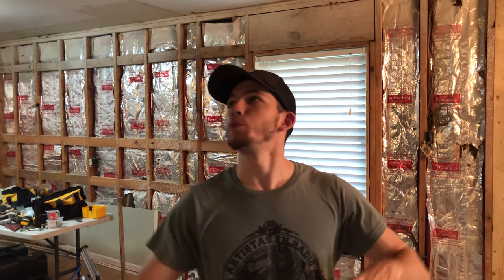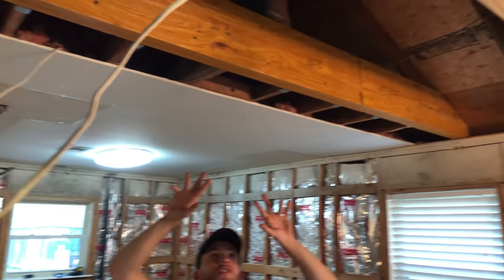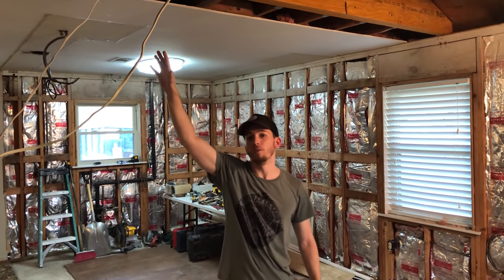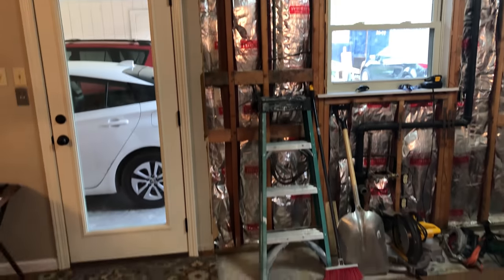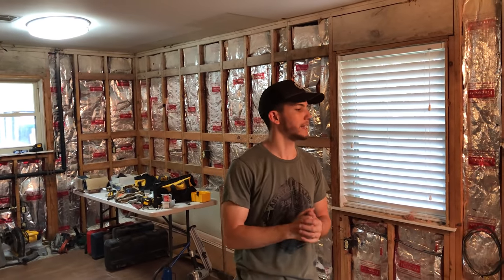All right guys, that is going to be a wrap for today's project. We have our beams up, installed in place. The only thing left is the double joist hanger right above me and we also have to install some filler joists between the two beams. The work site is clean, the beams are installed, everything went swimmingly. We've got to go back in the attic tomorrow to transfer the roof load, but we'll talk about that in the next video. Stay tuned for us cutting into this concrete — we've got to bring two conduits down from the attic into this concrete slab. Rough framing is almost completed. If you enjoyed the video, make sure to like it, consider subscribing for more content — we're doing this entire kitchen remodel A to Z. See you in the next one.